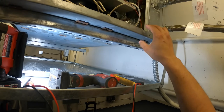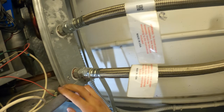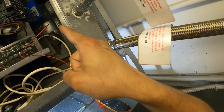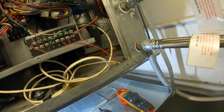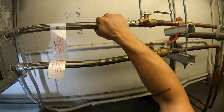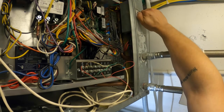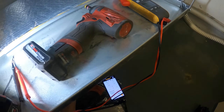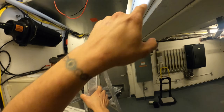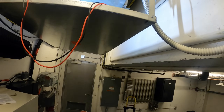We'll see if it's tripping on high pressure. A dirty strainer will shut off on high pressure. A valve actuator that doesn't open causes high pressure. Water not moving — high pressure. With that dirty filter, that could also shut you off on low pressure. Let's turn this on and watch the high pressure. I'm assuming this machine is 410A.